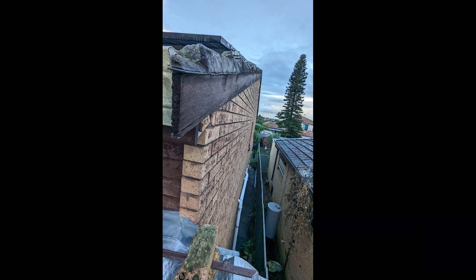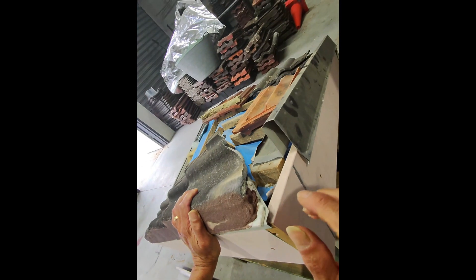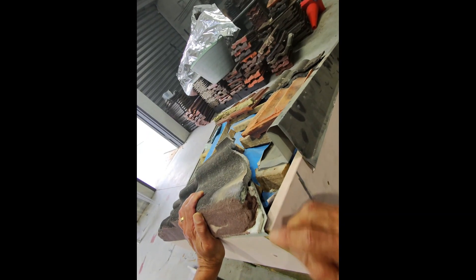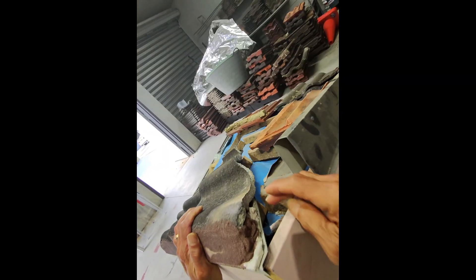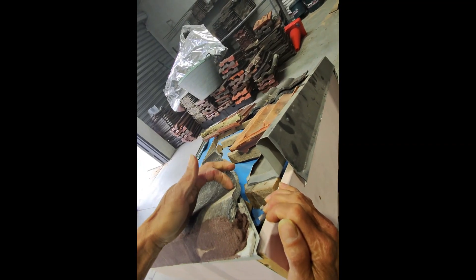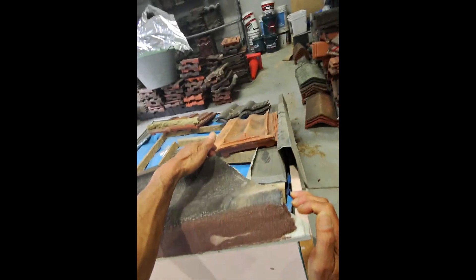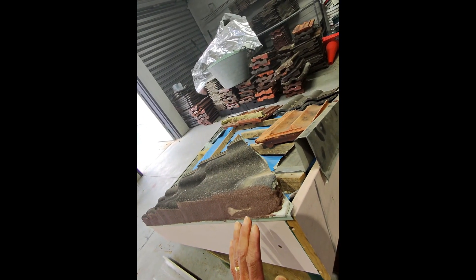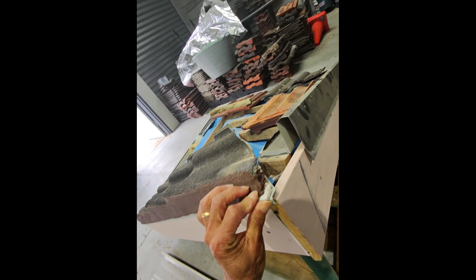This is what we find when we look at the old-style barges where the tiles are just bedded straight onto the fibro strip. Nowadays we always use a Z flashing. The reason it's called a Z flashing is it's shaped like a Z — it goes up a little leg, across, and there's a little hook that comes up. Any water that drips off the fibro strip will get caught by that hook and run down the Z flashing until it gets to the gutter, so you don't get a leak.